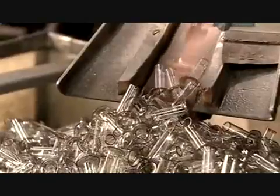The glazed tubes now enter a flare-making machine, which heats each tube until the glass is malleable, then stretches one end into a flared shape. The next machine loads 2 copper lead wires into the flare end. Then it inserts a thin glass cylinder called the exhaust tube.